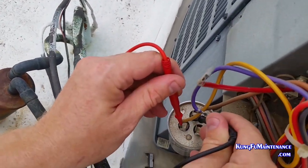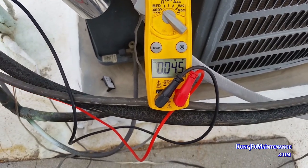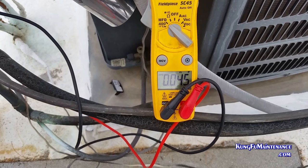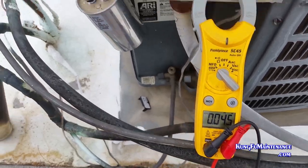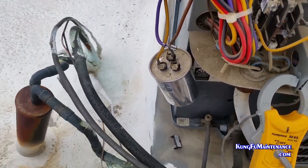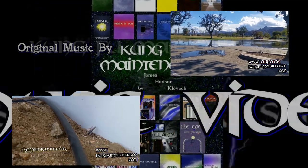On our fan, we should be showing 5 microfarads, but we just got nothing — 0.045. So we got a bad cap: 40/5. 5% of 40 is 2, so our cap would at least need to be 38 to be in tolerance.